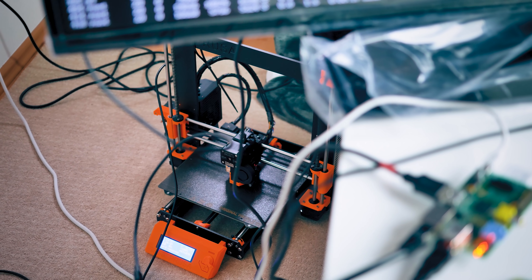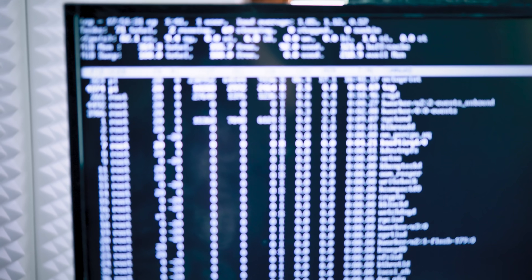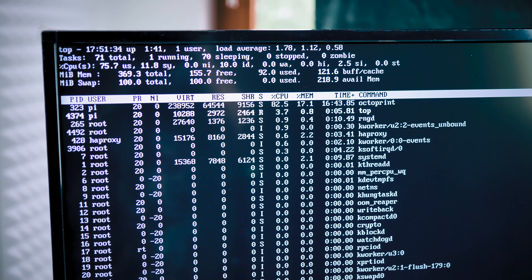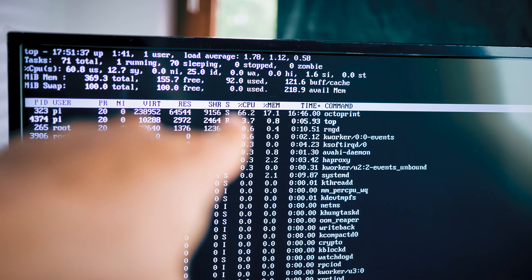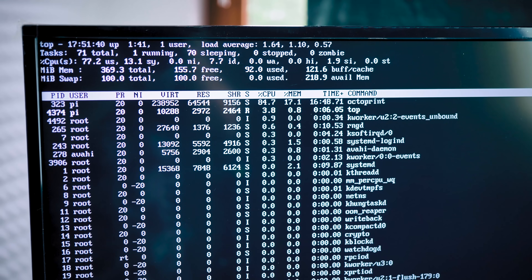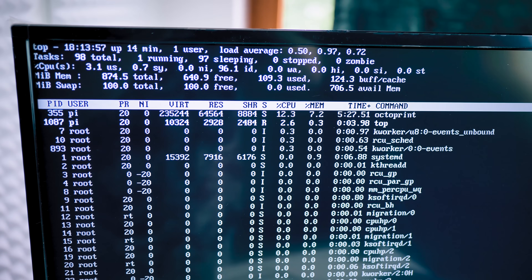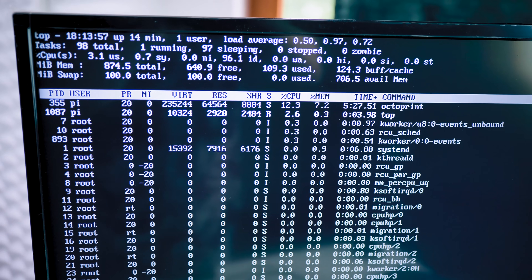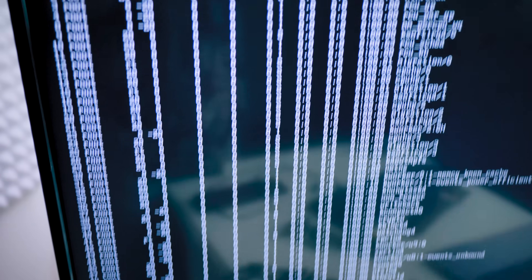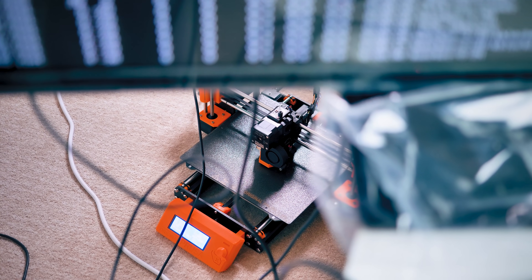For the Raspberry Pi 1, I was constantly seeing loads between 70 and 85 percent — that's on the upper limit, an uncomfortable amount of load. This thing is just completely busy with streaming G-code. So besides the load times, this is not a good choice for running Octoprint. The Raspberry Pi 3 was a lot better: 15 to 30 percent on a single core, so it still had the other three cores available for the web interface and system services.